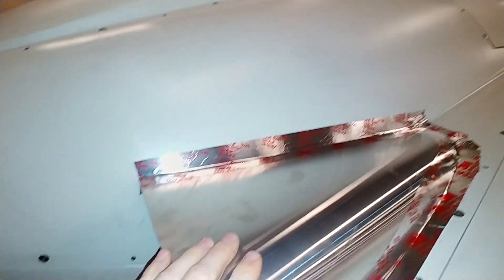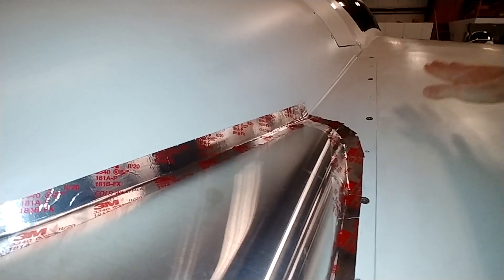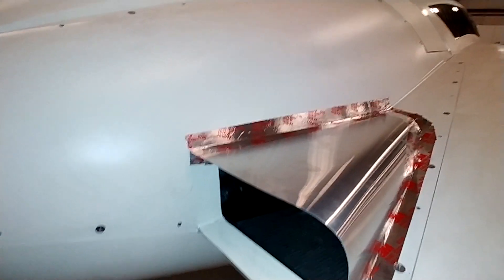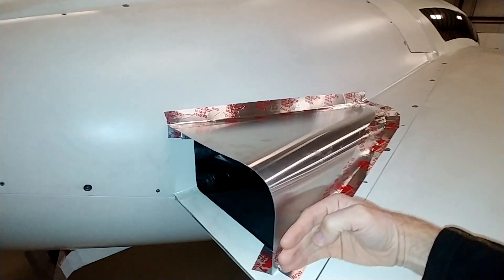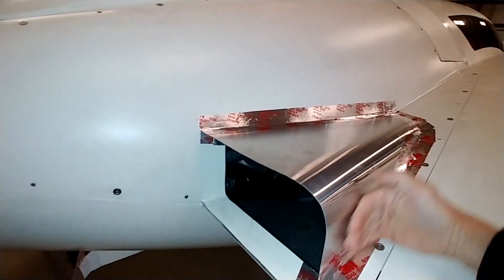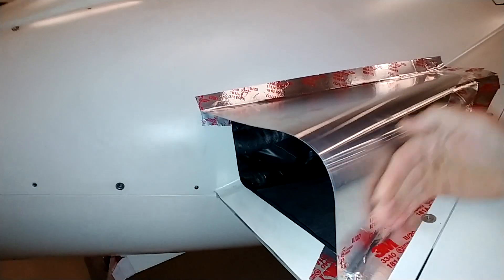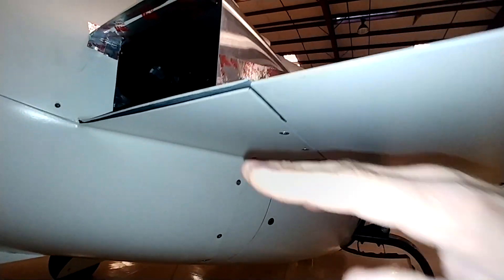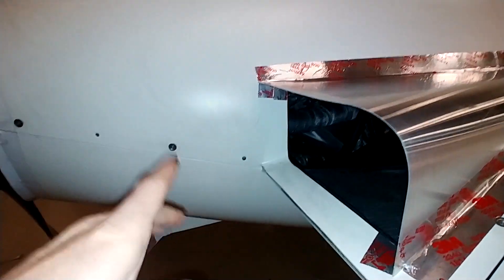Going on the inlet up there I have about 124 square inches, so I'm not quite one-to-two ratio but I'm way better than I was. One of the advantages is that the high-speed air coming down the wing will ramp up onto this and flow over here, creating a nice low pressure. The air coming down here will be deflected outboard — it's pretty much in a straight line, flying straight back rather than curving in along the fuselage — so that'll create a nice big low pressure area, and underneath it's basically a straight flow from under the wing.